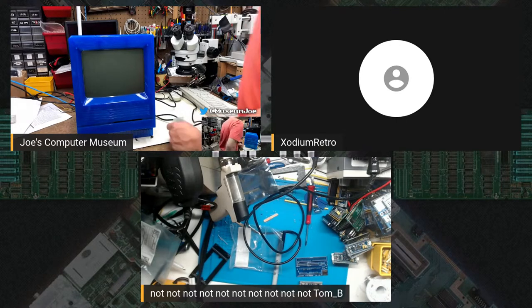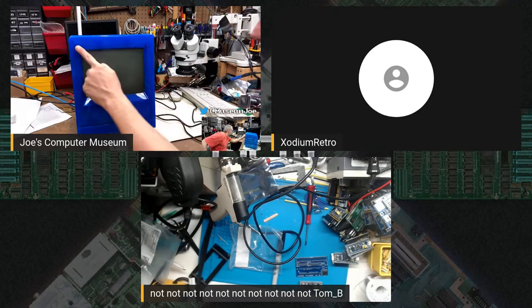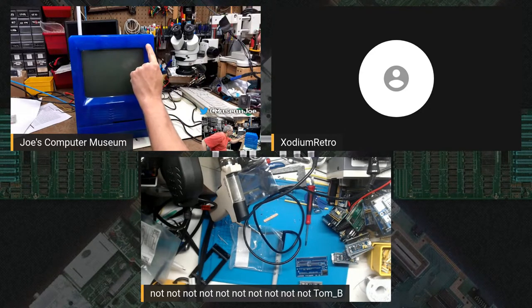The only pad I messed up on the SE board was one where I didn't do that method, where I had every pin desoldered except for one, which was slightly desoldered, but enough that it was grasping onto a pad. So I lifted a pad with that, so I had to bodge that one.